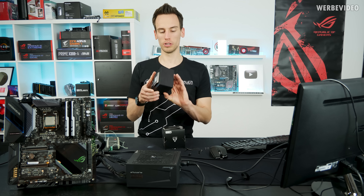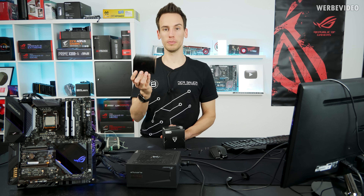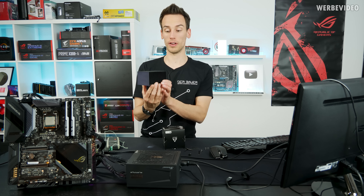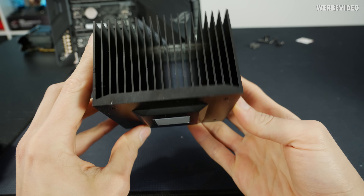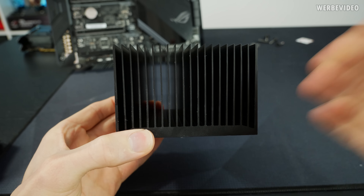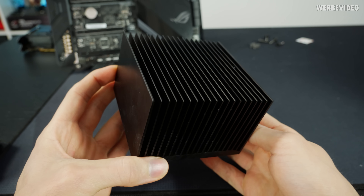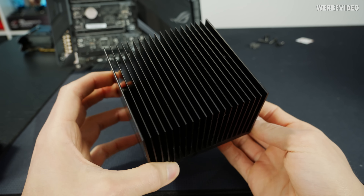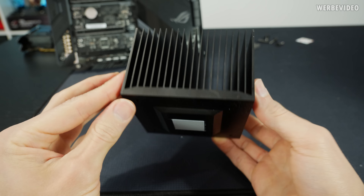This is a very simple aluminum heat sink, just aluminum extruded out of one shape. When you have this very long aluminum heat sink you just cut it into individual pieces with the right size. Without anodizing and everything, it should not be more than $3 to manufacture probably. On the bottom you can see there is some CNC work done — we have this elevated piece in the middle, which is probably to keep some distance between the CPU and the heat sink.